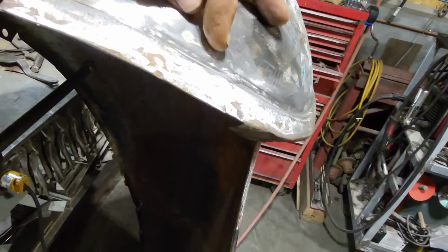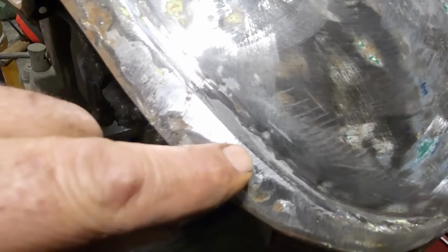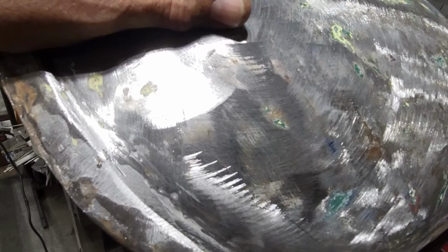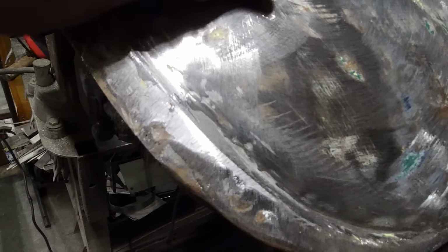And all this down here was mangled, so I'm going to have to put a lip on the bottom side of this here after, right? Then I played around, dollied, of course, I caught the piece out of it. I turned around and dollied a bit more. It's quite interesting because there is some lead repair right here. That is a vintage repair there. That was done when this car was still being used way back in the day.